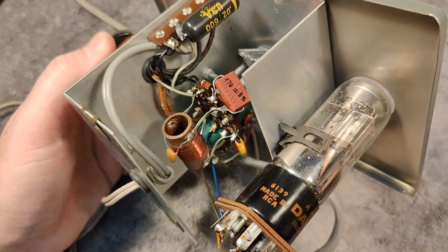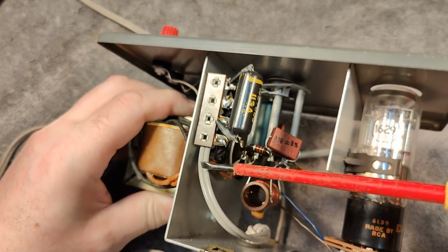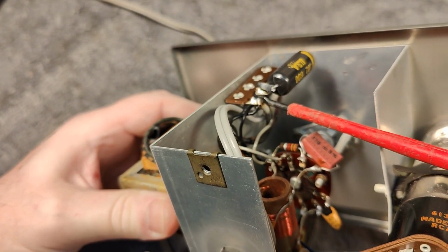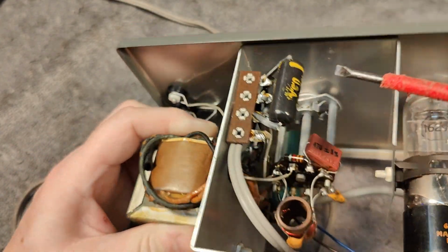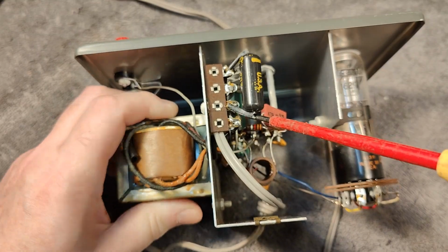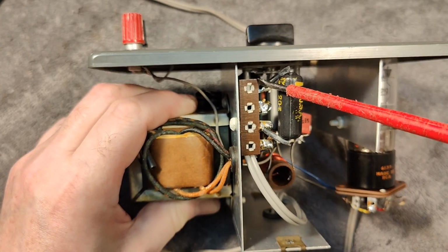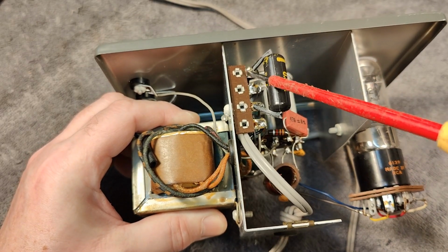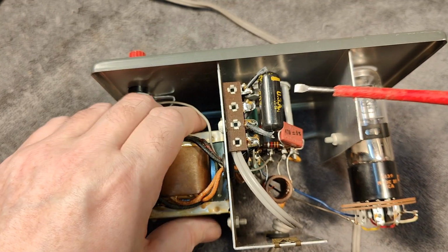I did find a few things to talk about here. The first is this capacitor, and it is mounted between one of the mains input wires and chassis. So this screw down here is the chassis screw, and it goes here. Now it goes to this point here. So that is the capacitor, and it's ground here and stuff, but then it goes to mains, and you don't know how this is flipped. It could be phase or it could be zero.